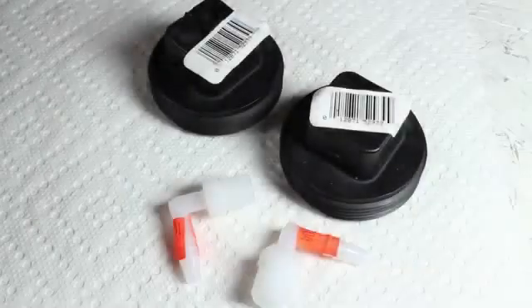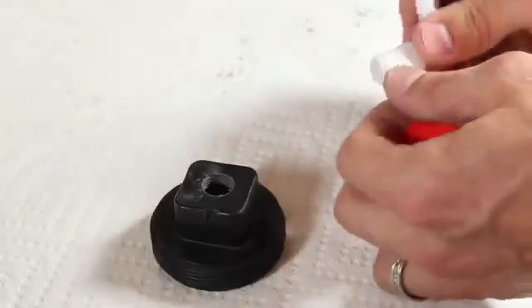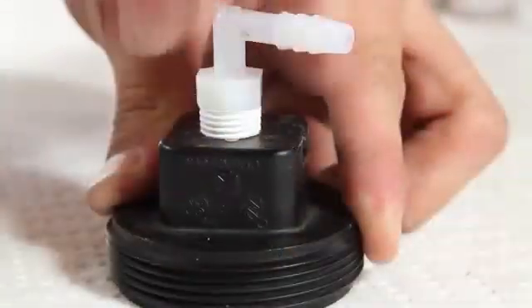While that's drying, let's get to work on making the bubbler. I want to attach this ¼ inch 90 degree elbow to the cap, so when the stickers are removed, I'll grab my ½ inch drill bit and a tap. The hole is drilled in the center, then tapped at 18 thread, just before adding pipe tape to the elbow adapter and screwing into place.